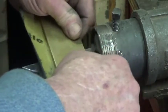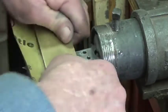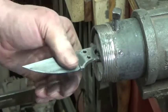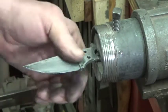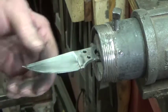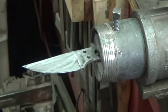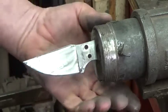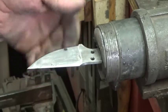I do the flat back here — it's going to show from where the handle ends up to the plunge cut, and then I just come forward. This water holds the grit and the metal you're taking off up in suspension, and it kind of aids in showing those scratches. I don't see any, so I'm going to run it up here and check the false edge in the same way, and then we're going to foil wrap this and get it into the furnace.